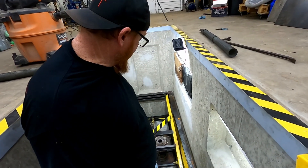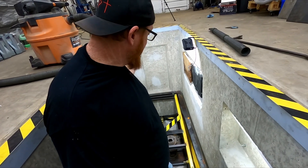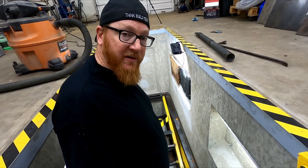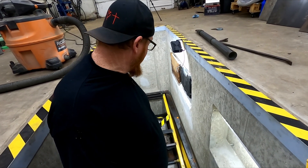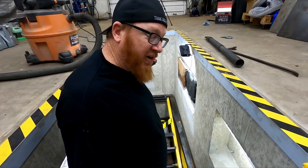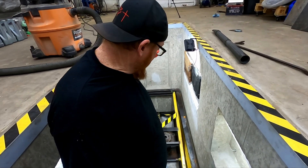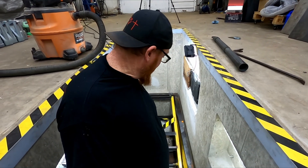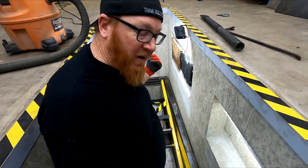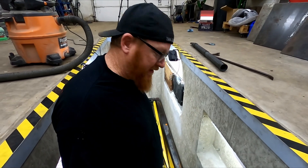Part of my failure with this pit has been that when it comes down using the reverse hydraulics, it snaps together real fast because the momentum of the X-frame is exponential to how far the ram travels, so it goes way too fast and slams down. I also had an issue with it not getting lifted up easily, so I installed a spring system to reduce the speed and give it a little lift help, but it didn't work great — it still slams down and creates torsion in the frame.